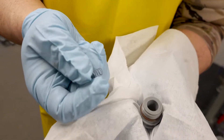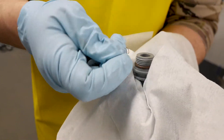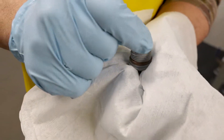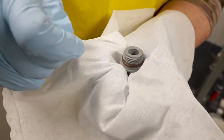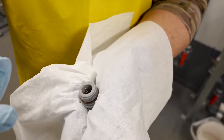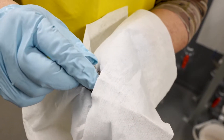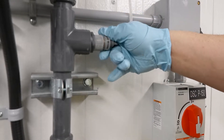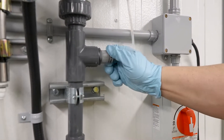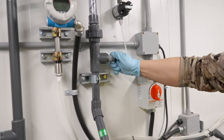We need to make sure we have the right pressure on here. I would check this at least once a year to make sure it's been working, or just replace it once a year — that's just as good. We put our spring back on top of the ball and our cap goes over top of it, then it can be reinserted and threaded. We do not want to put wrenches on this as the plastic will crack — that's what the brown o-rings are for, to seal. So good and hand tight.